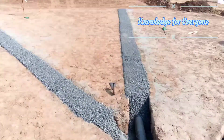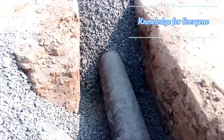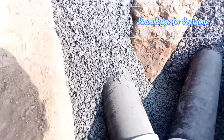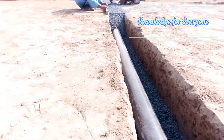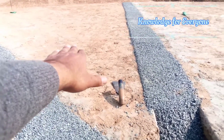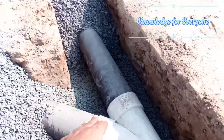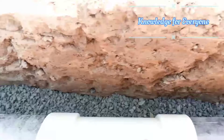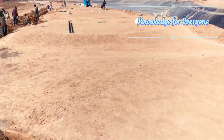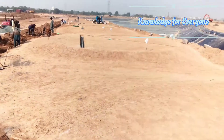We have left and right laterals and the central line. This pipe is covered properly from all sides by crush material which is 5mm diameter — you can see it here and in this trench also. Any excess water from irrigation or rain will come from the surface, go down through the highly porous media quickly to the filter pipe, enter through the slots, and be carried away. This provides better aeration so roots get oxygen properly, and moisture stays at field capacity.